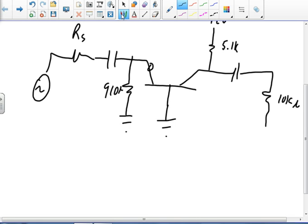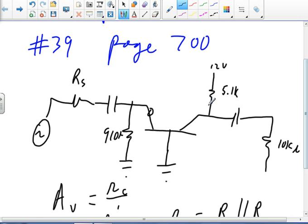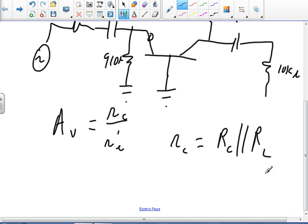And that appears to be page 685. So the voltage gain is going to be RC over RE prime. And now, the issue would be, how do we do that? So RC is going to be RC in parallel with RL. So the collector is there. So that'd be 1.5K,